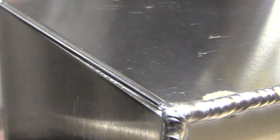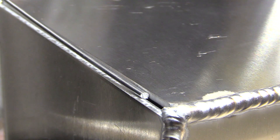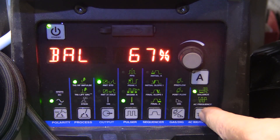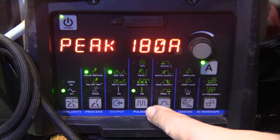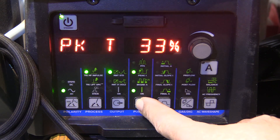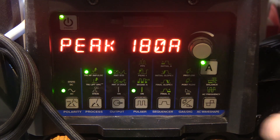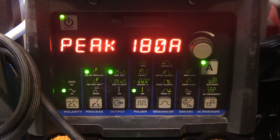There's a little bit of a gap now — not a big gap, but I thought it would be a good opportunity to show the technique of just running over the wire when you have a small gap. I was using 140 amps and the foot pedal without pulse. These are my settings: balance at 67, frequency 100 hertz — that's a good all-around setting for this thickness. With pulse I had to go up to 180 amps, one and a half pulses a second, 33 percent peak time and 33 percent background.